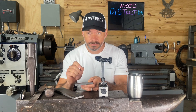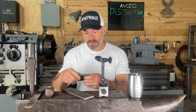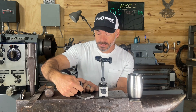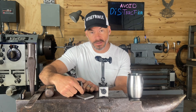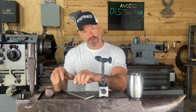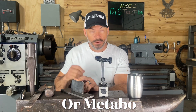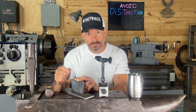If you're hung up on it and you think it's going to mess something up, here's what to do: say you're making a T-joint and the mill scale is heavy. Start up here on the shiny clean metal and come down to put your tack right there — always start on the clean metal first, then come down to your problem area. It gives time for grease and trash to burn off. Then take your grinder and just zip it along in the joint — just disturb it, break it up enough so you won't have any trouble welding. Your second pass, you won't even notice it.